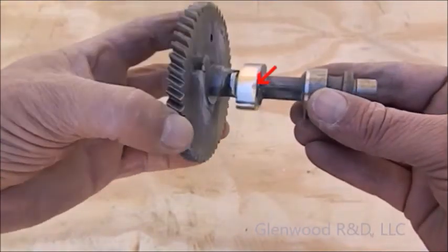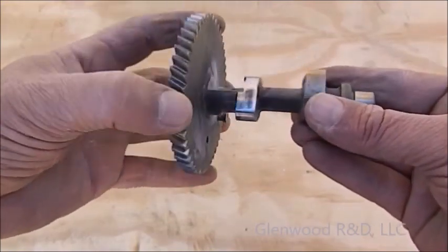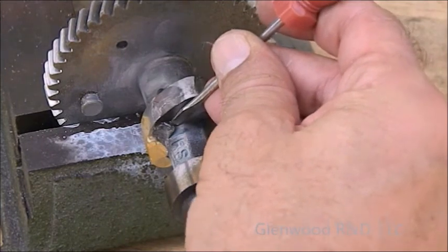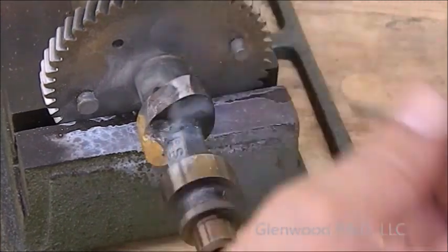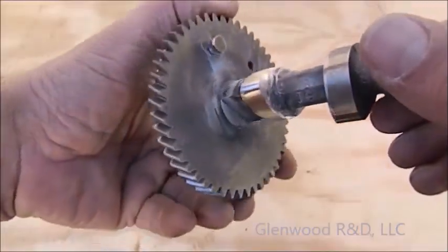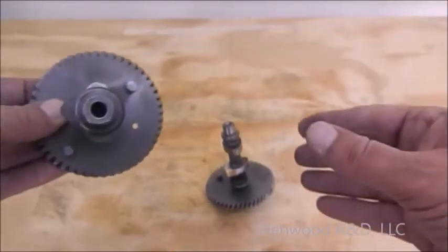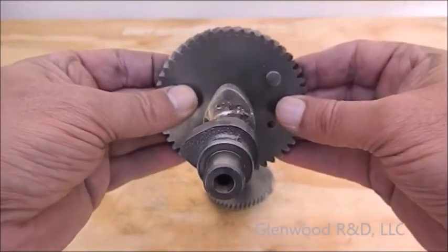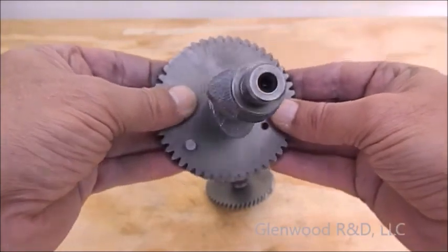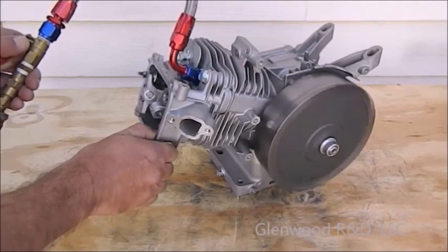Small divots like this are okay as long as there is a suitable, smooth, flat surface for the tappet to follow. You must also remove all of the glass-like brazing flux. Your initial cam should look like this — a new lobe should mimic the original. Exact final sanding and adjusting will occur after performance testing in the engine. You are now ready to proceed to video number 3 by using the link provided in the description of this video.